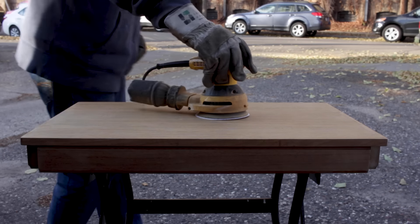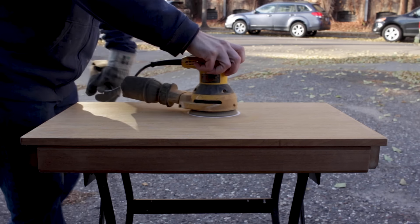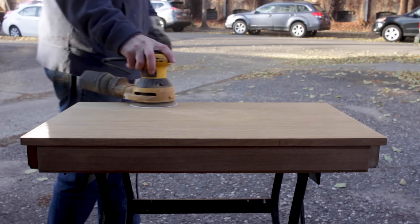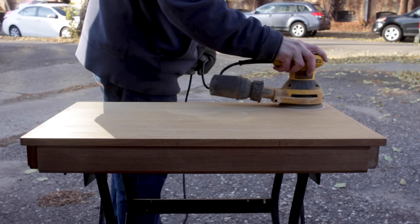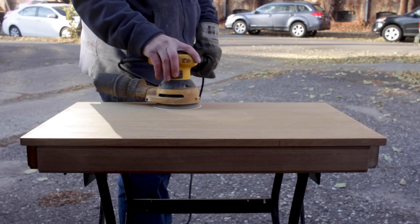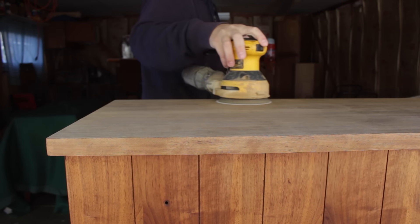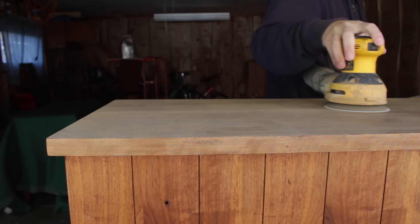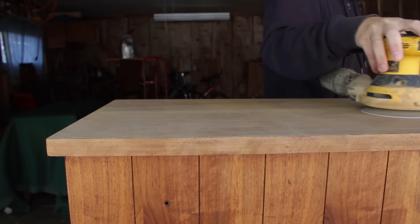And then there's sanding, and I try to avoid it as much as I can. Most of my videos do contain some amount of sanding, but I try to do as little as possible. This is because most of the pieces I work on have a thin veneer, and it's really easy to go through that veneer or do damage to it with sandpaper, especially with a power sander. So if you are going to try to sand a finish off, just be very careful. Start with the highest grit — or finest grit — paper that you can, at least to start with, and be especially careful around the edges, as that's where it's easiest to sand through veneer.